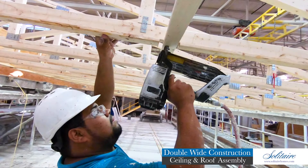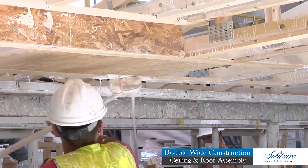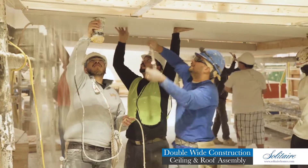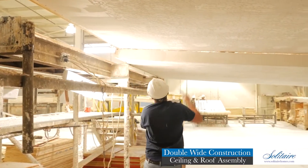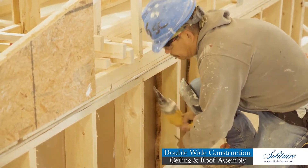After the roof is framed, we install our unique ceiling grid system that ties all the rafters together with one-inch solid wood members for the entire length of the home. This allows for greater surface contact to the construction glue that is applied between the grid system and the hand-nailed half-inch thick sheetrock ceiling. After the hand-applied texture is complete, the roof assembly is installed on the home using metal straps and four-inch long wood screws, tying all wall assemblies to the roof structure.